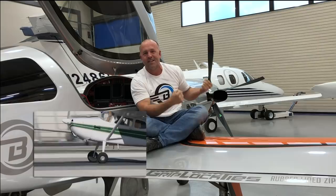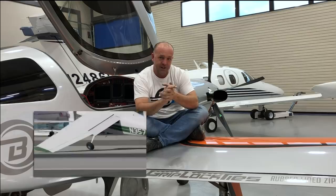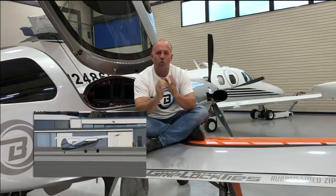It just happens so slow. Sometimes there isn't damage. But unfortunately, most of the time when that wing hits, there's a shock load force that goes through the spar. It usually bends the aileron, bends the tip — when really it would take very little to stop that wing from impacting.